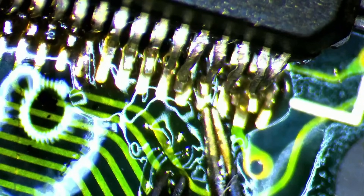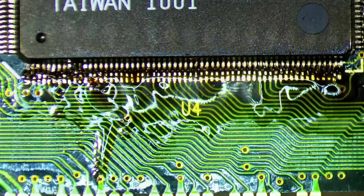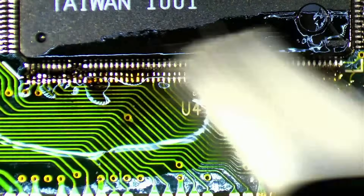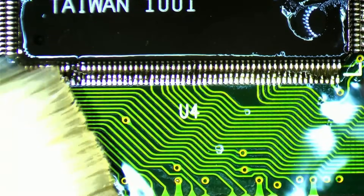One wrong move and those tiny metal legs will break off. I won't even try to get some of them back in shape. Others just have their base tilted or twisted — the tweezers do an amazing job getting those defects rectified. After a few moments this side is also ready to be resoldered, though here we need to be a lot more careful. Once I was done with both 3DFX chips, I cleaned the areas with isopropyl alcohol and inspected the card once more.